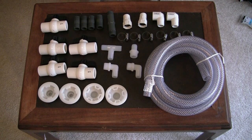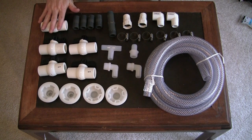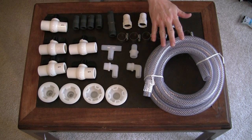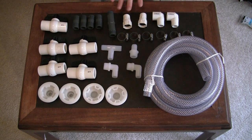If your caps are not threaded in the center, you're going to need to purchase new bung caps of the appropriate thread — coarse or fine — and then thread the center. You need the pipes to connect into those, some valves to isolate the barrels and water flow, some connectors for the 3/4 inch inner diameter tubing, pipe clamps, and some other miscellaneous fittings. I'm going to rearrange all this on the table so you can see how they actually go into the barrels.